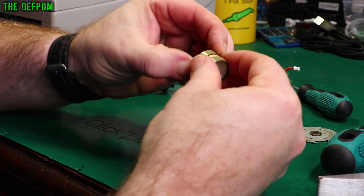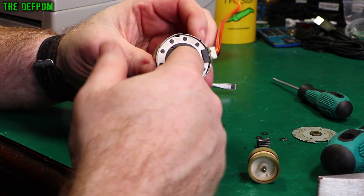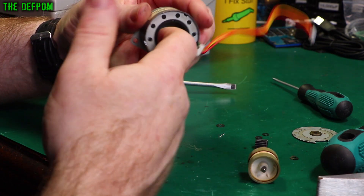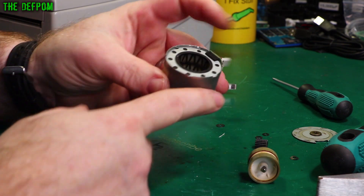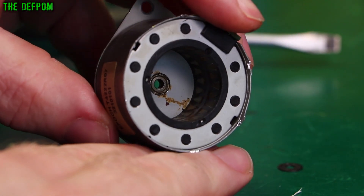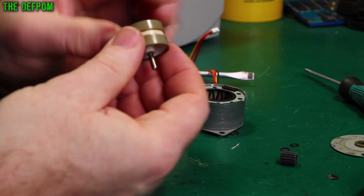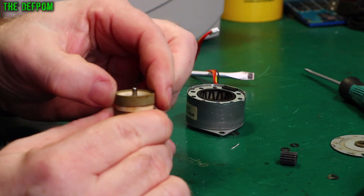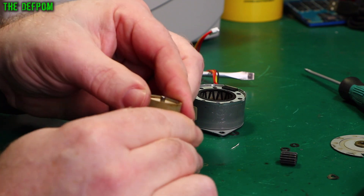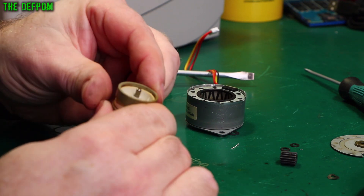What we've really got is these slip rings in here like this, and in here we have this interesting arrangement for the coils. So for some reason it's binding on this, and this slip ring here on these... for some reason these rings on here — this one here is turning. It's actually not tight. So... maybe that's what the problem is. It's gone out of sync. Because sometimes it's fine, other times it really wasn't. This other one's tight.